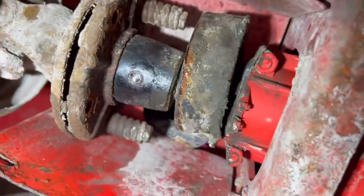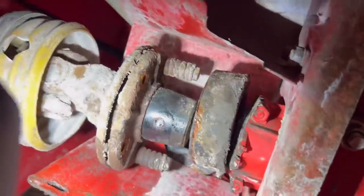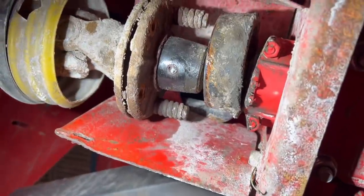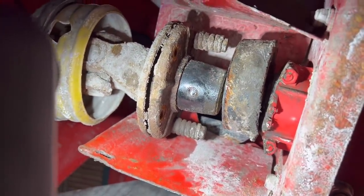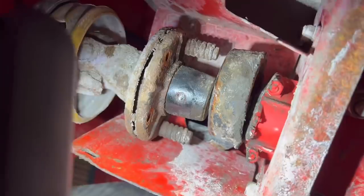I've tried drilling it a bit but all the drill bits are kind of broken and blunt. So we're going to go get some new drill bits and see if we can drill it. If not, we're going to take the rest of the springs out and then the bolts in the clutch, pull it off with the bearing puller or the slide hammer, get it in the vice, drill it out, re-tap it, and put a new bolt in. There's no panic because we've not got the bush for inside here yet anyway.